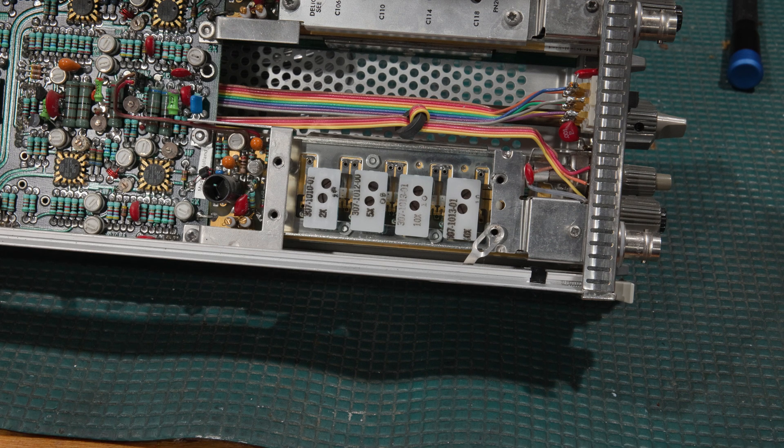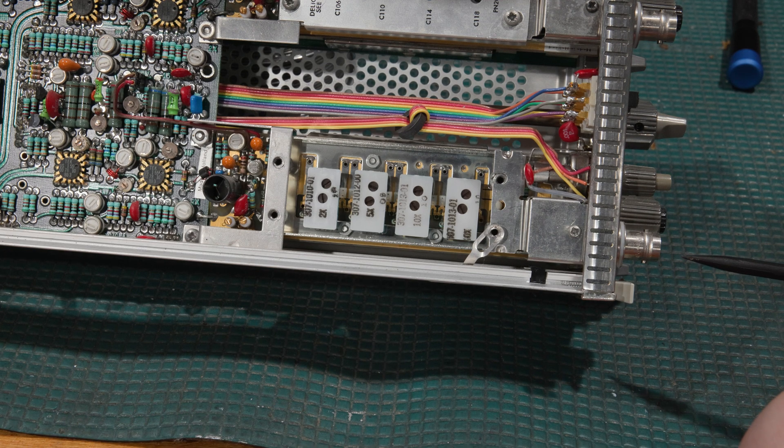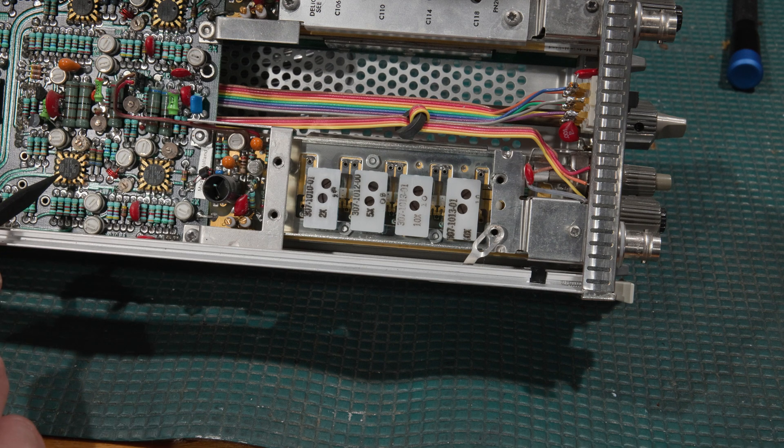The overstress is dependent on what happened and how fast and how large it was. One of the reasons the balance is so important is because we start single-ended, and at this transformer right here, we flip to a differential signaling. So this is a differential amp and this is a differential amp. We have differential signaling all the way through the chain — even the delay line is differential in some of these scopes. That does a couple of things: it lets the amplifiers have good common mode rejection, and it also helps stabilize some things. But as with op-amps and a few other things, when you have differential signaling you can have some balance problems, especially when you're driving the signal right at crossover.